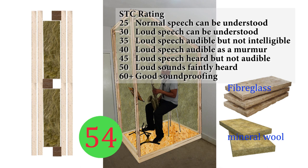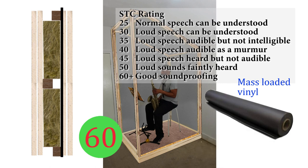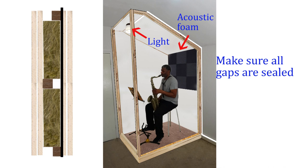Make sure you check the safety aspects of the insulation you are going to use. In this design the insulation is fully sealed within the framework, but you might need to further seal it with a plastic sheet so no fibres get into the air. To increase the STC rating further, you could add mass loaded vinyl, which comes in different thicknesses and therefore different mass — the more mass, the more soundproofing. Mass loaded vinyl is good for soundproofing but can be expensive; the advantage is that it's a thin material compared to other options. For the best option, you could use two sheets of drywall with a space between them created with green glue on both sides of the stud, lined with mass loaded vinyl and insulation inside — though this might be overdoing it just a tad. Whatever you do for the walls you would have to do something similar for the base so that sound does not escape through it. You will also need to seal the edges so there are no gaps for sound to escape through — there are many acoustic sealants on the market.